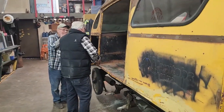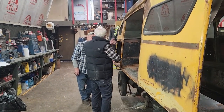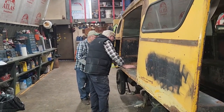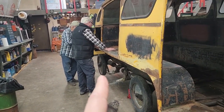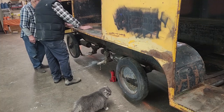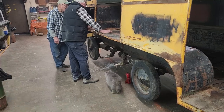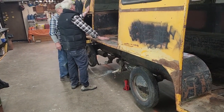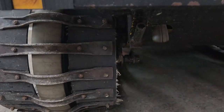So again, we got Mr. Evans here from Regina, Saskatchewan. He's the gentleman that makes the plastic fuel tanks, and he's just dropped off some tires. We just did the whole spiel on it. Dad did some measurements, and he said that it's probably not ideal on the rear one, but the first three, yes. The reason being is if you put on new tracks, as the tracks wear out, they're going to spread on you, and eventually you'll have issues with that tire and the track adjuster. And I'll show you right here. The track adjuster being on the back here, that's eventually going to give issues.